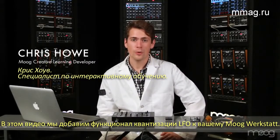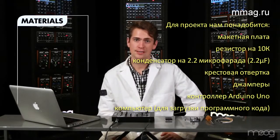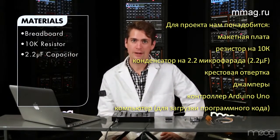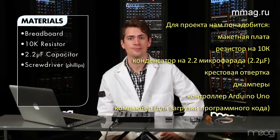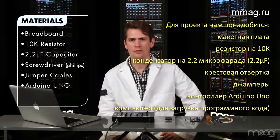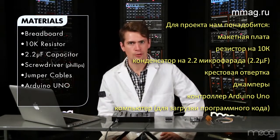In this video, we're going to build a LFO Rate Quantizer into your Werkstatt. For this project, we'll need a breadboard, a 10K resistor, a 2.2 microfarad capacitor, a Phillips head screwdriver, some jumper cables, and an Arduino microcontroller. You'll also need a way to upload the code to the microcontroller.